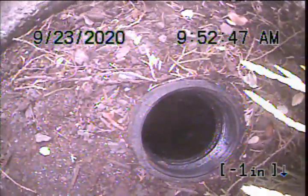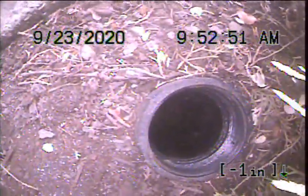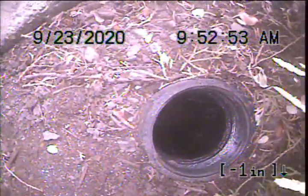Hello, this is Richard with Sewer Sluice. Today on my property at 17638 Southwest Ballard Lane in Sherwood, Oregon. I'm located near the front step here. We've got a 3-inch ABS two-way clean-out. This is going to be my point of access. I'm going to advance out and check the overall condition and serviceability of the sanitary sewer line.